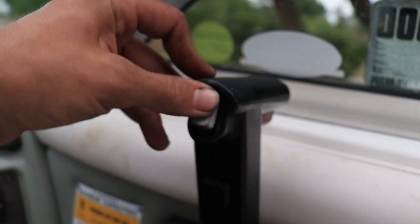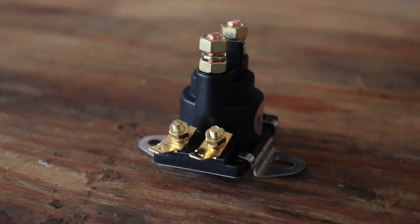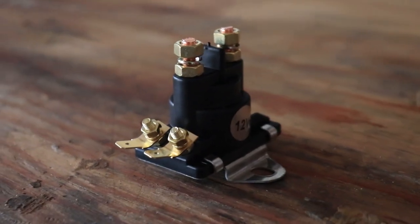After the clunky noise was fixed, it was now time to tackle another big issue — my trim would not go up. Usually trim is a really easy fix. All you have for trim systems on a boat is a switch that goes to a plug, and that plug goes to two electrical solenoids that go up and down on your trim pump. I busted the old multimeter out, did some troubleshooting, and it turned out my solenoid wasn't getting the signal it needed — the solenoid was in fact bad. So I went on Amazon and ordered that bad boy. As you can see here, it's an awesome solenoid for your boat — super cheap, does the job, exactly what you need. I'll put the link in the description.